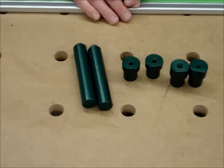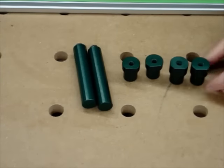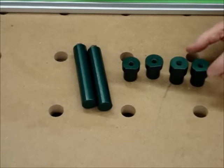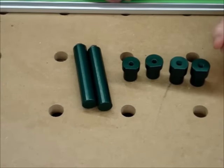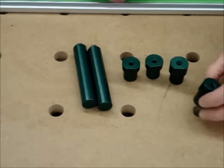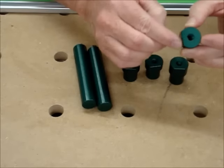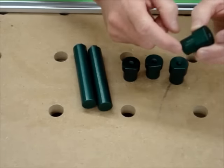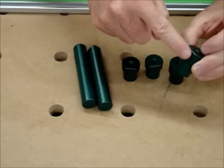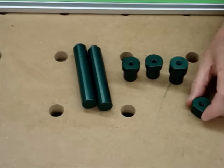These are quality products. They are made of anodized aluminum. In my opinion, I've got several other brands of bench dogs which I all like — they're all quality products — but these particular bench dogs take the best qualities of all of those and roll them up into one package. The first thing you note is that the dogs have a flat face milled in them, and these flat faces happen to be flush with the shaft that fits down into the MFT holes. More on that later.